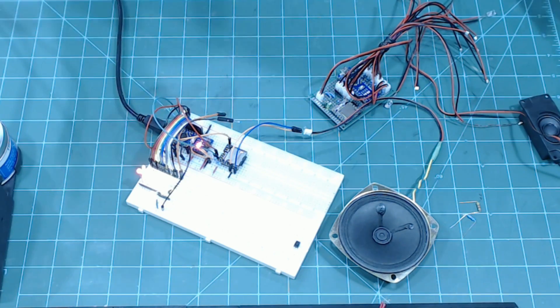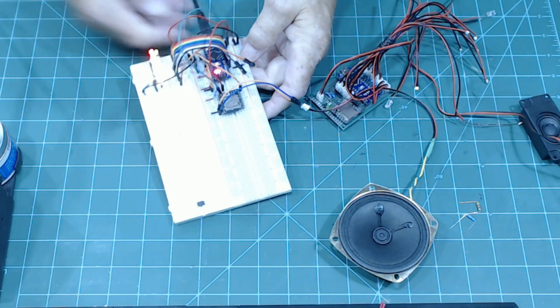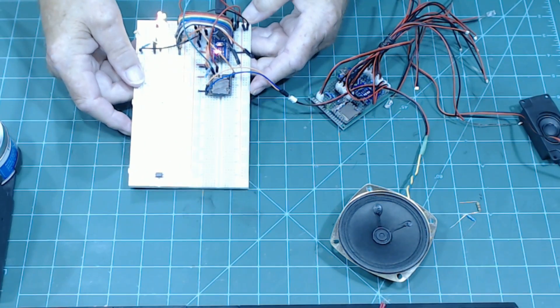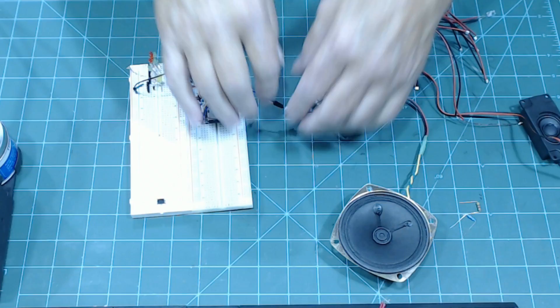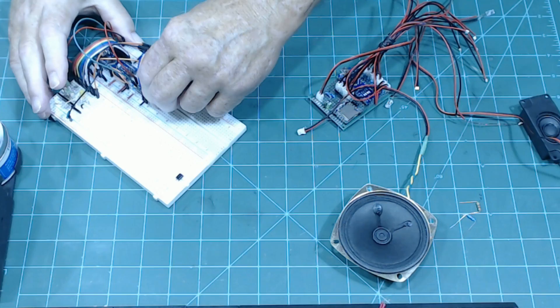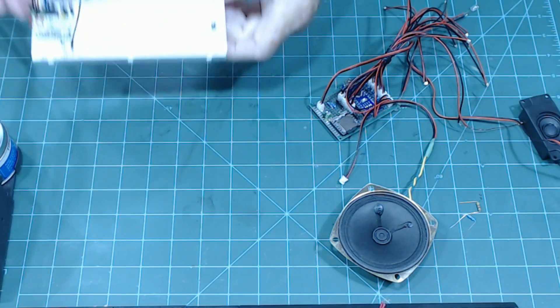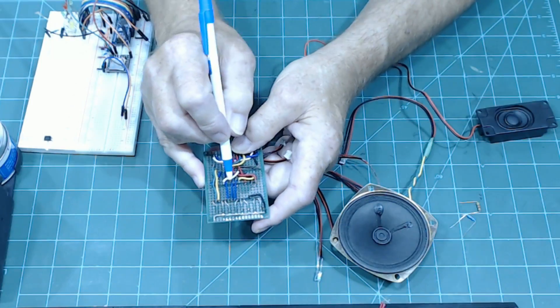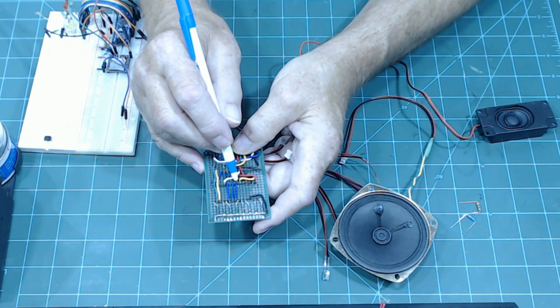These resistors here aren't making good contact, but these are the same resistors that I'm using on the circuit board and I have them soldered in so they're making good contact. Also on some boards you can see these are two different colors - two different manufacturers. Depending on the manufacturing plant they come from, they may be a little sloppy. These are two different brands of boards right here. I have to move some of the pins from one side of the nano to the other to eliminate the interference for the TX and RX pins 0 and 1. I have four available pins right there that I could use.